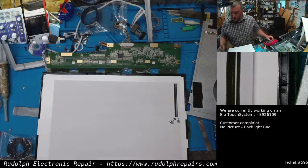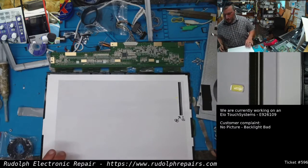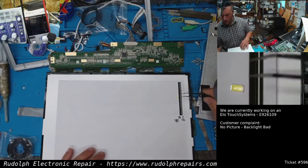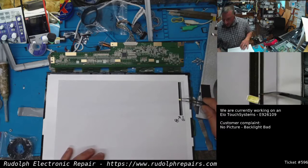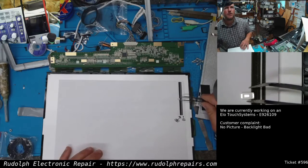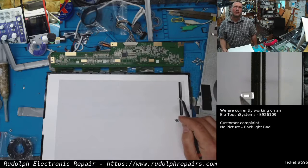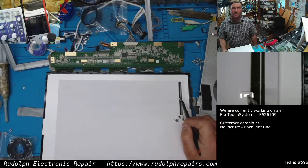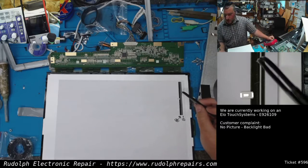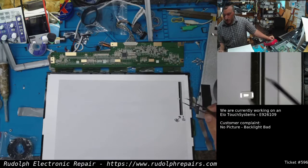This is what we came up with here. This is the LED, and this is just the PCB we designed, printed out on paper for demonstration purposes. If you flip over the LED, you see there are 3 contacts there: one on the left, one on the right, and one in the center. The contact in the center and the contact on the left are both positive, plus. The contact in the center works as a heat sink. So what we did is make a fat trace, which is going to solder to the center and the left contact, and a thin trace, which is going to solder to the right.